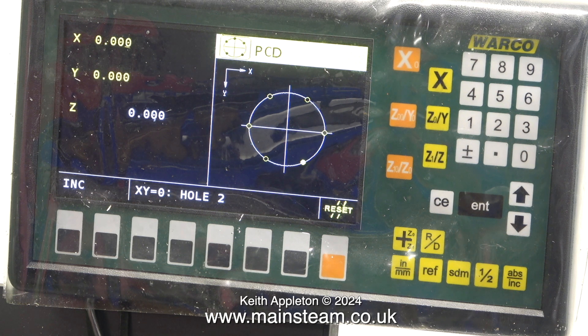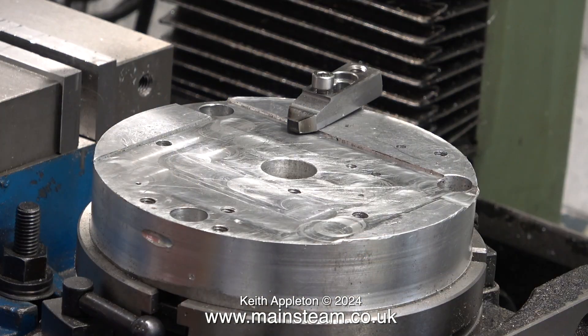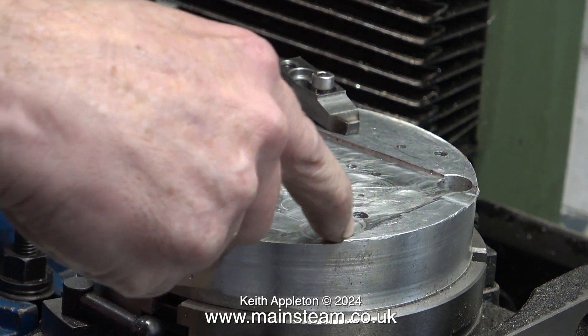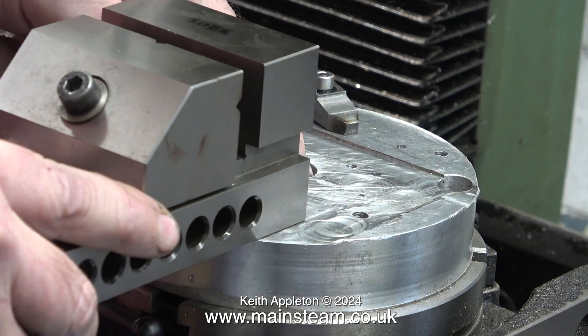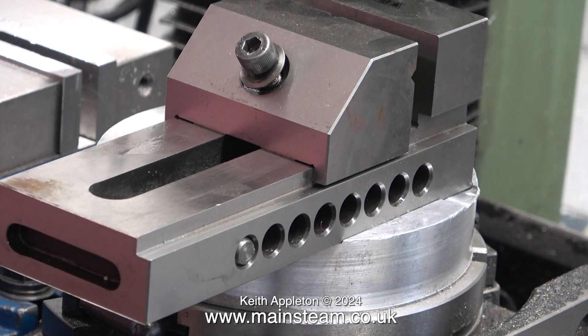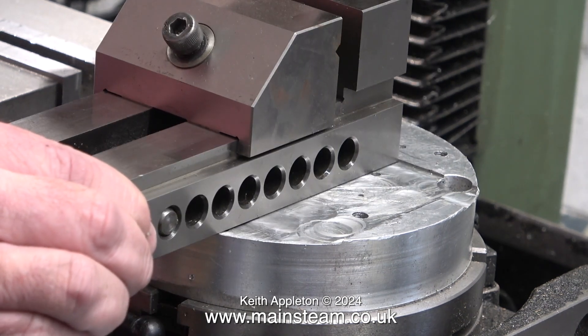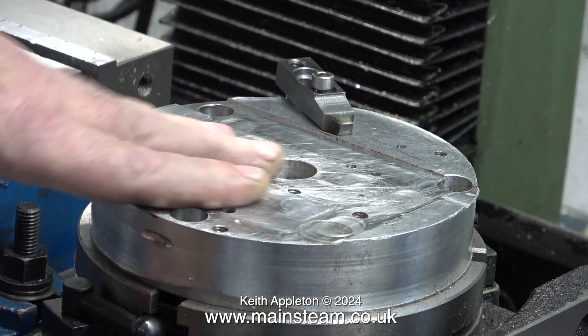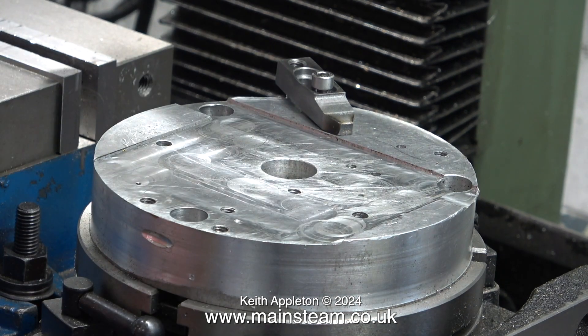Having said that, Andrew has a rotary table with a jig on the top of it. He's milled out exactly vertical and horizontal lines to fit the centre line of the rotary table. He was making a drag link — you have to have two holes and also machine the outer boss on them. Because he needed six of them, the jig was used and then simply slid across to do the next link. This is called a sacrificial plate on a rotary table. You can drill holes in it, mark it, and skim it off any time — but you're not drilling into the table itself. I've never really thought of doing that — I drill holes in my rotary table, but making one of these is a good idea.